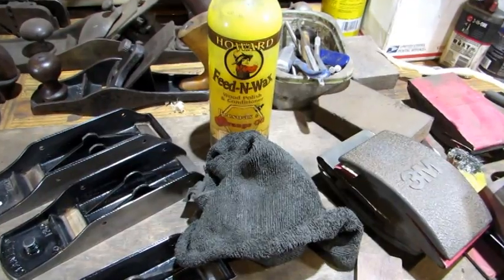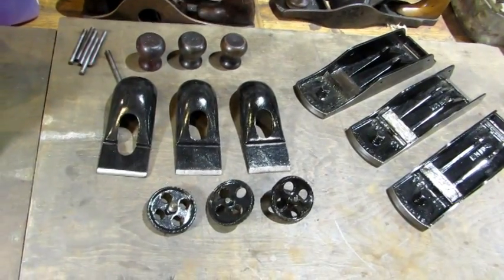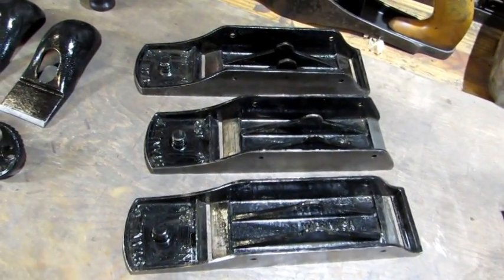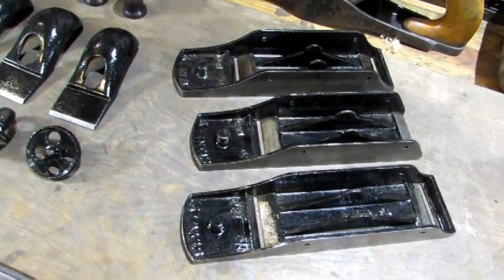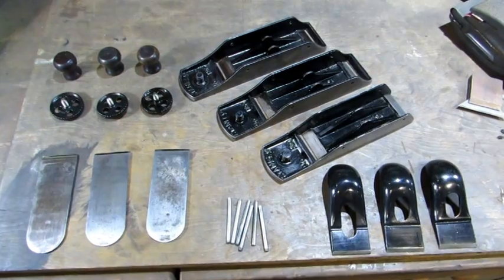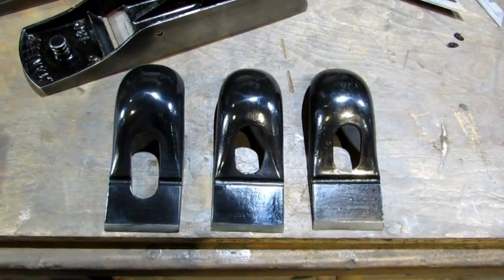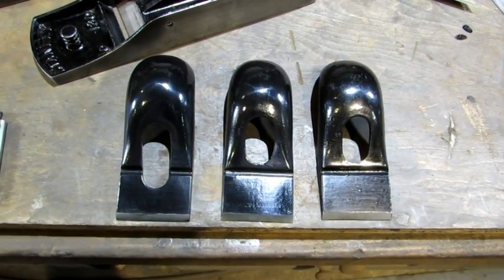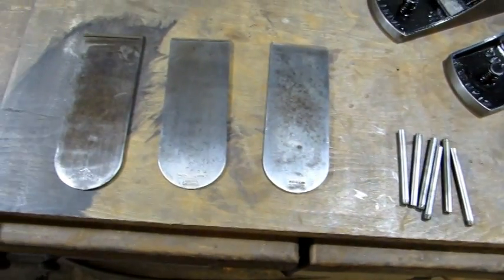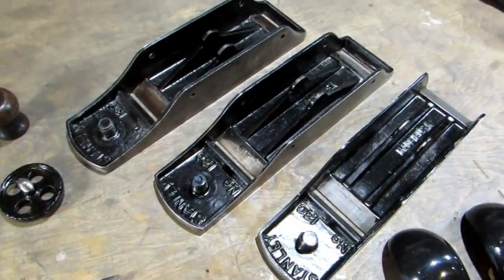So it's on to the dirty oil. Here's another look at the parts after I've worked the dirty oil into every nook and cranny. After this it's going to get wiped off, a coat of wax, and these beautiful number 130s are going to be ready to go back together. Here's all the parts ready to go back together. The caps came out just beautiful — the one on the right was the original Japanning, the two on the left are the ones I've redone. Everything's been waxed and the bottoms look really good.